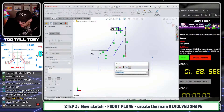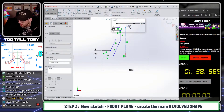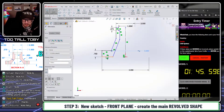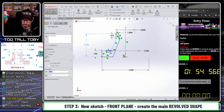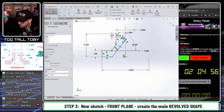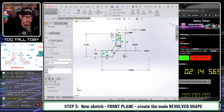The diameter dimension here is going to be a diameter of five. Now that I've picked that center line once, I can just keep picking lines and keep adding dimensions and they're going to automatically be diameter dimensions. This makes it a little bit easier to go through and pick all your diameter dimensions at one time. Then we can do our final max height dimension and our angle dimension — that one is 55 degrees — and then our wall thickness dimension of 0.5 and our wall thickness dimension of 0.5 for that upper region. Two minutes to that first sketch.